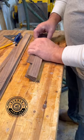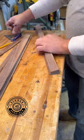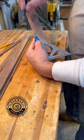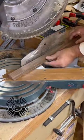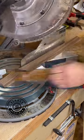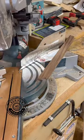I made story sticks for easy measurement of the sides of the picture frame. I marked it off and now I'm going to do a 45 on each side so I can go back to my miter saw and cut that to the correct length. You can see a ridge carbide blade really getting me a clean cut.